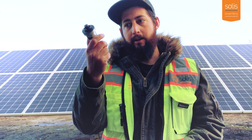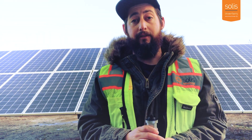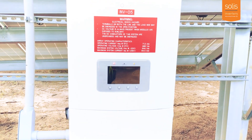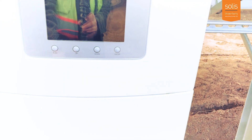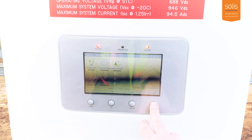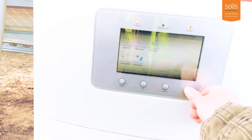We're all plugged in and ready to go. The upgrade is on here, the firmware stick is ready to go. The inverter DC is on and we're going to upgrade that firmware now. The inverter is in the on position, DC disconnect is in the on position. These inverters are powered up by the DC side, so you do not need AC. I recommend turning off the AC when you're messing with the settings and just leaving the DC on.